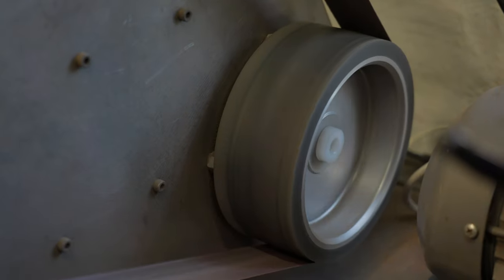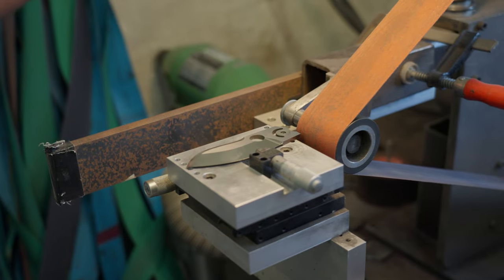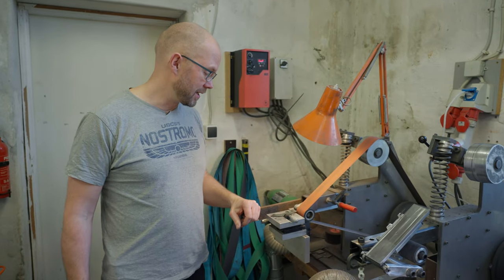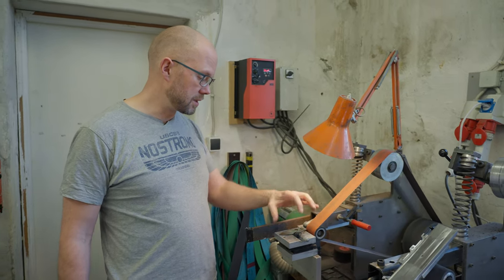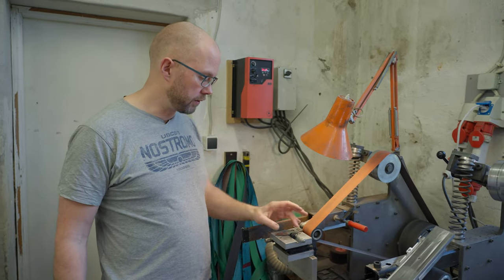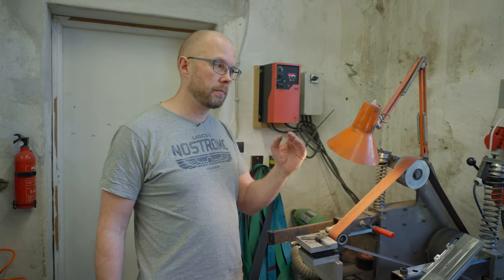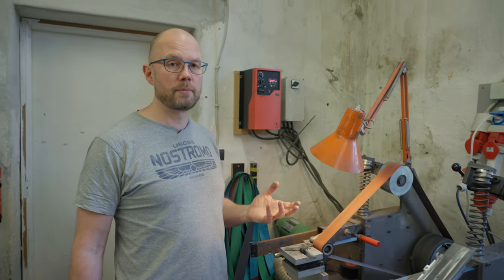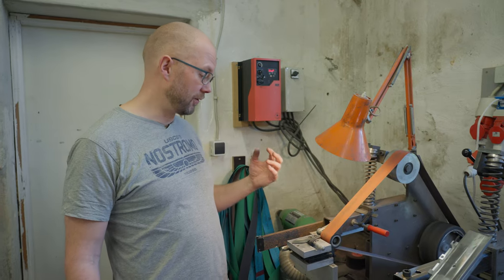This is a precision instrument. This little contraption here is actually a guard to protect the mechanism — the tape is to somewhat protect your skin, but it's mainly to protect the mechanism. I can adjust the angles, the height, the depth, everything with these micrometers. This allows me to adjust the lock face angle and the depth and lock engagement by the thousandths. This is something I'm rather proud of having made and it took me way longer than I care to admit to figure out and build.